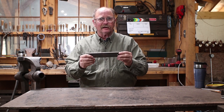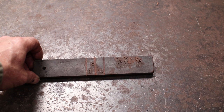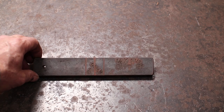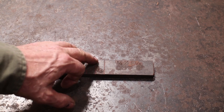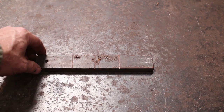I have a pattern piece here that I keep hanging on the wall that tells me exactly what I need to do to start this axe. You can also measure because this is full size — it's not just a template, it's a full-size start. It says it's half by one and a half, cut nine inches long, so that tells me exactly what I need to start with. Centered on my center line I need to have an inch and a quarter mark. The center line is cut in here, but you don't do that on the finished axe — it's just on the pattern so I know what I'm doing, because if it was just pencil marks it would wear off. On the backside, centered on the center line, I need three and a half inches to my marks. So the first thing we need to do is cut a piece of material that exact same size, put all of our marks on it, then we can head to the anvil and get started.